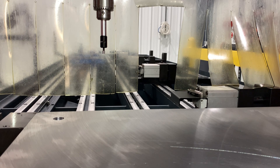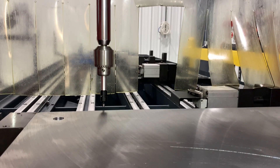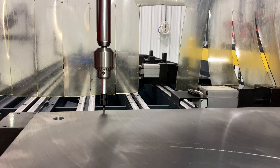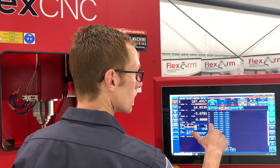I'm moving Z down first using the pendant — I have more control that way and don't want to break the edge finder. Slowly jog it down into place. Moving X in because we want to touch off on the X-axis to set our back left-hand corner as our zero point. Moving 10 thou at a time — going to one thou now — jog X positive a little more. There's the red light indicating contact.